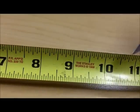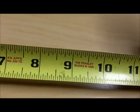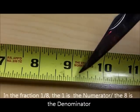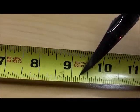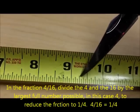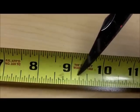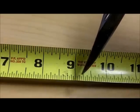We're looking at a portion of a tape measure and I'm going to show you the fractions of an inch. When we're talking fractions, we can talk about the parts of a fraction. The top number is called the numerator; the bottom number is called the denominator. You can break fractions down — for example, four sixteenths: divide the numerator in half and the denominator in half, and you get two eighths. You can further break that down the same way — four sixteenths is equal to one quarter, and that's the way it would be accurately stated.